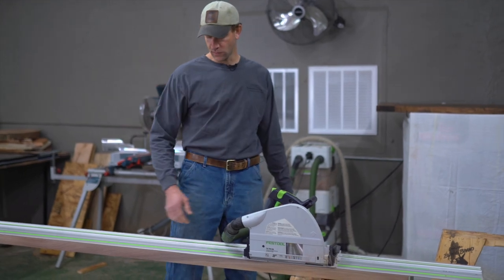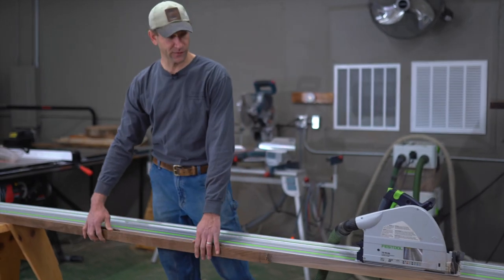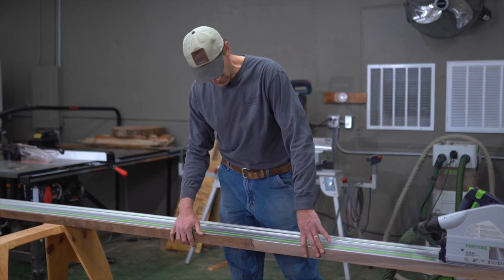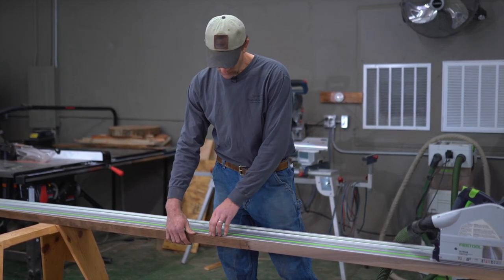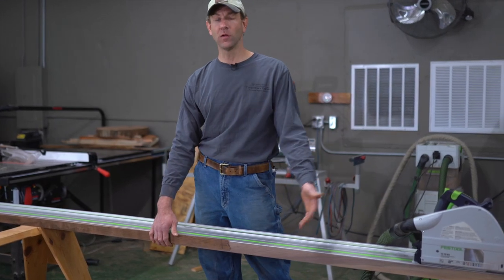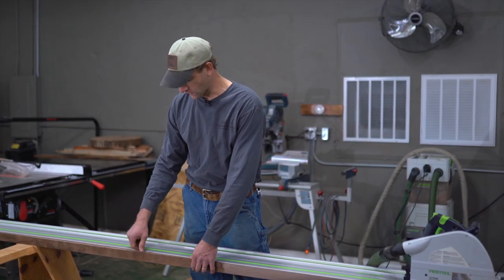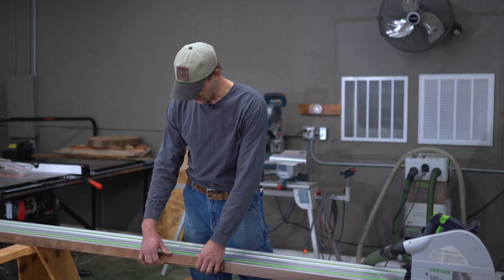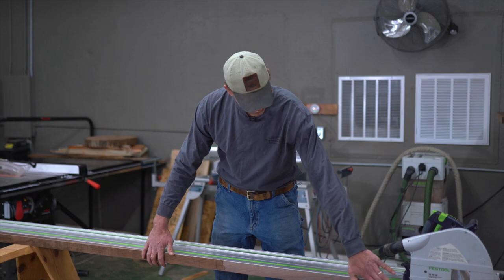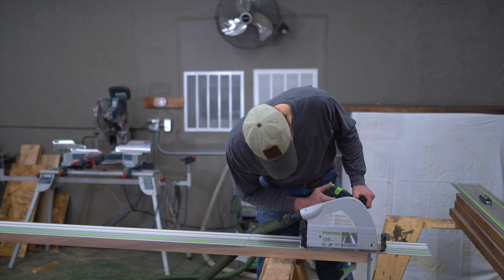That went really well. While the saw blade was cutting this strip off here, I had hardly any dust thrown out right about here — I was kind of going more towards a skim cut, so the blade was not sandwiched between the wood. I had a lot more sawdust getting thrown out from the saw. That's normal, because normally the contour of the blade would suck the sawdust up and the vacuum would get it when sandwiched in between the wood. If you just have a skim cut going on, that sawdust gets thrown everywhere.